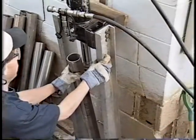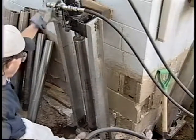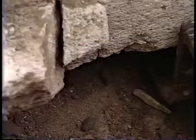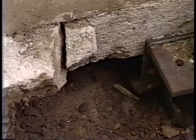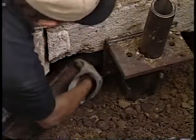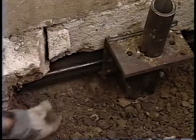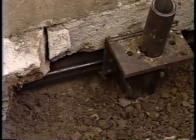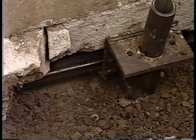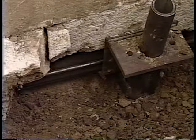Once the foundation moves with it tight against the seal plate, you will be ready to lift after the rest of the piers are driven. If a crack develops in the footing on either side of the bracket, you will need to bridge the crack with a piece of 2-by-4-by-quarter-inch steel tubing placed on top of the pier bracket. Now that you have the steel on the bracket, raise the bracket tight against the footing, replace the cribbing, and continue to push the tubes until you reach load-bearing strata.